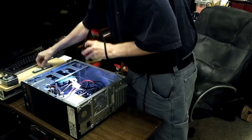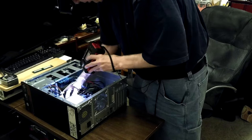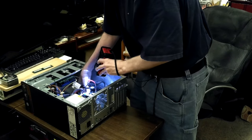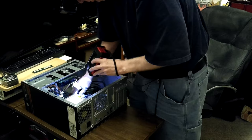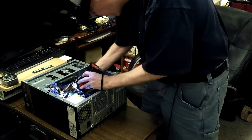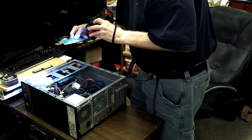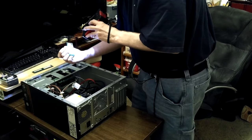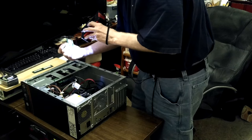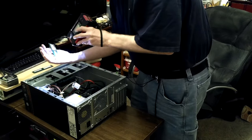It's a two gigabyte stick, which is what it should be. If there was something wrong with the RAM it should be beeping, but it just doesn't do anything — like it's not getting power. I've seen him pull the RAM out before without asking what was wrong with it first. It changed how it acted because we'd already tried turning it on once, and he didn't get it snapped back in good.